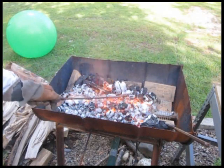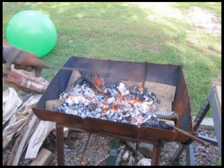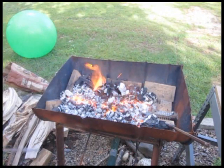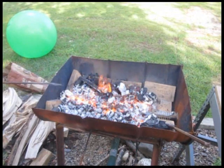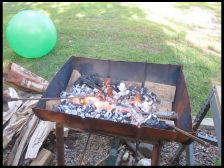It's very important that you keep a close eye on this. Move your coals around. Monitor the whole sword. Make sure it's all heating up evenly. Move it around, back and forth. Move the coals around. Get it nice and hot — the whole sword evenly heated.